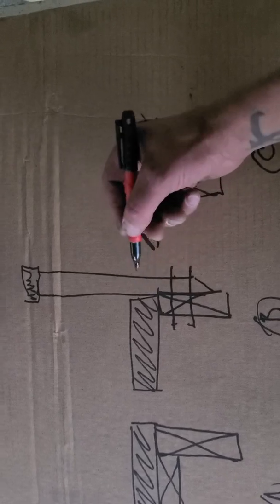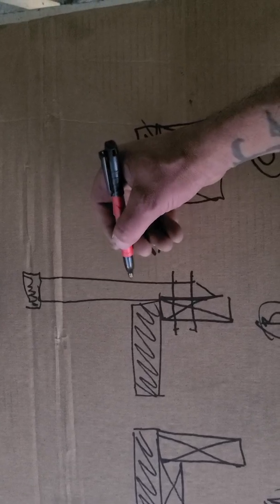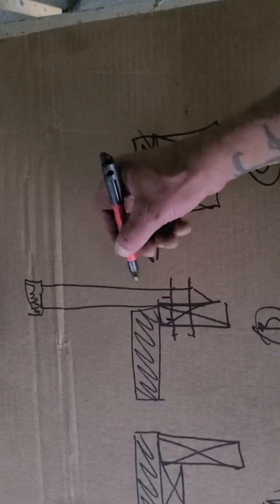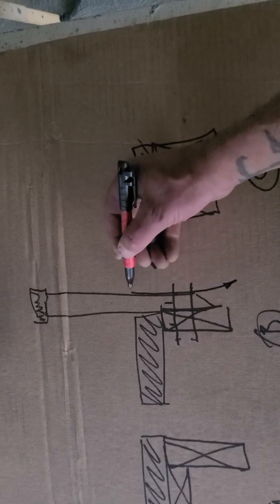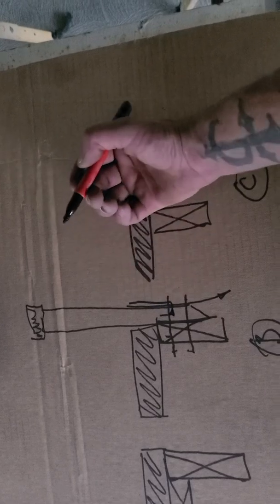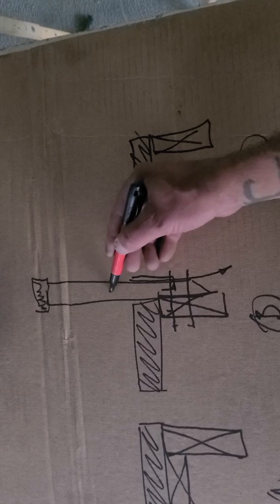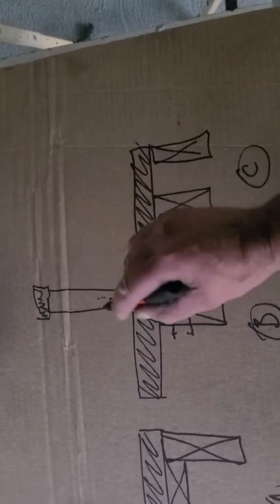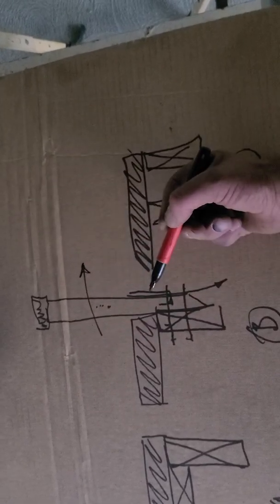There's an advantage and a disadvantage to this system. The advantage is that it's really hard to get water damage in your fastener holes, because that water tends to just roll off that. And you're probably going to get some of it that wicks into that hole, but very few and far between. The disadvantage is that you have a structural piece, which is your railing. So if you have toddlers or drunk friends, this becomes a weak point, right?